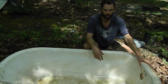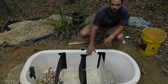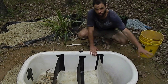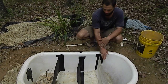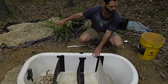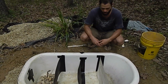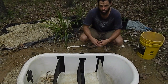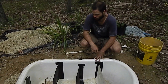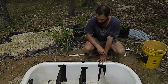We've got phase two of the gray water system. We've got our three baffles in place — two high and one low. The water is gonna drop in from our outdoor sink, drop down, come up, drop down, come back up and out. Through that whole process it will be going through our gravel and also our sandstone. The sandstone is a key factor in the filtration process because it absorbs water and pulls out all the toxicities. Then we have our plants that will pull that up and continue the filtration process. Everything you see here will be dropped in and that will be our completed process.